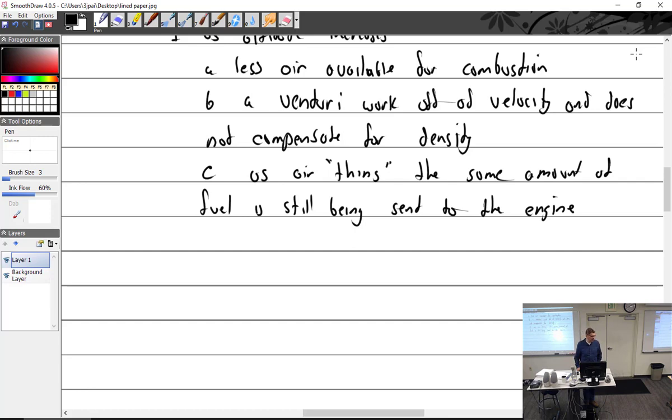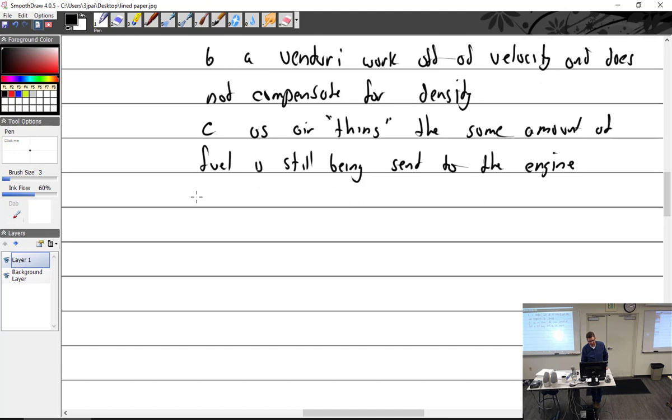And now let's take it in August at 3 o'clock in the afternoon, and do a run-up. How many gallons per hour am I going to get? 10, because the Venturi didn't know the difference. So it's still giving me 10 gallons per hour and I have a lot less air. So the engine's going to be a little rich, not as much power, wasting fuel. So we have to be able to compensate for that. And of course, that's just an example on the ground.